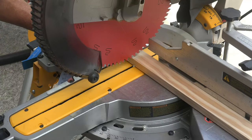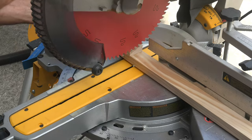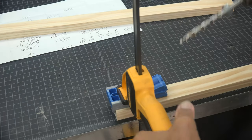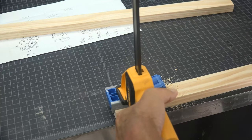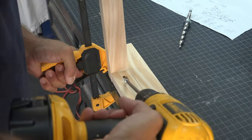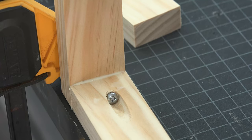With that measurement I made my shorter cuts. Measure one piece and then stack the other one you just cut on top of it so both pieces are identical. From there you will need to join your pieces together. None of these pieces will be seen so you can simply nail or screw them together, but I take it a bit further and use my pocket jig to drill pockets, then screw all the pieces together. I also use wood glue to give the corners extra strength — yes, this is overkill, I know.